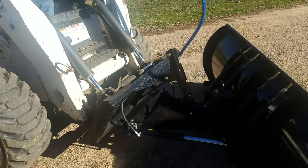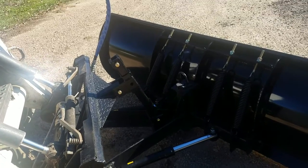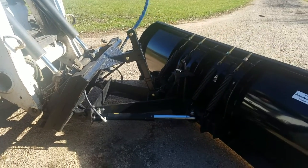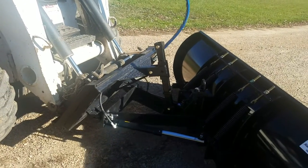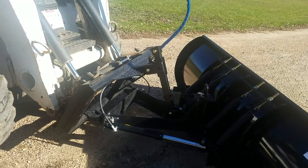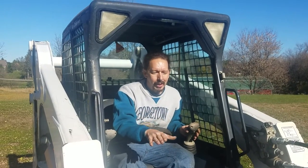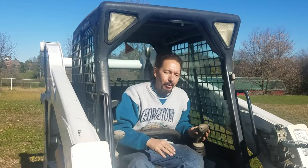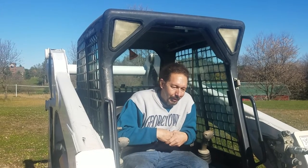I like to run right about the middle of your motion when plowing. Set the A-frame level to the ground, then roll your base plate forward until you're in the middle of your float and you're good to go. As you're traveling, you'll see that collar slip up and down, giving you a good range of motion and float cadence. As you go over uneven ground, the plow can float up and down. Your only weight on the cutting edge is the weight of the plow unless you roll forward to put more weight on it. Most of the time, the weight of the plow does all the work — saving the life of your cutting edge and giving you amazing use out of this unit. That's the features of our 8-footer. Thank you for watching.